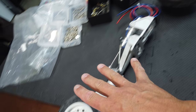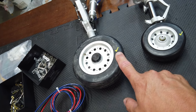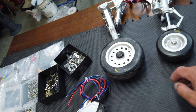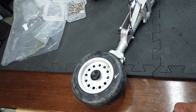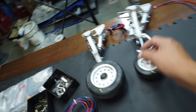Essentially we've got a few different friction pads going on, but it pretty much only goes together one way so it's quite straightforward. The reason you need to take this apart is because we need access to all those bolts to loctite them. All three gear have now been loctited - you'll notice a check mark on the wheels. I finished those two last night and just finished this one as well, so all the gear have been loctited.